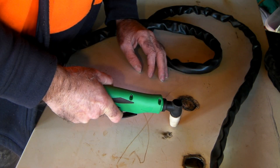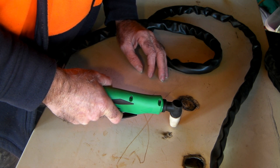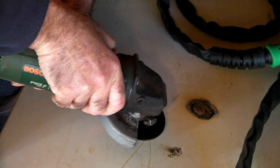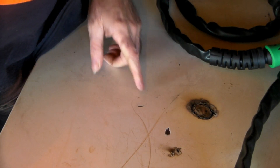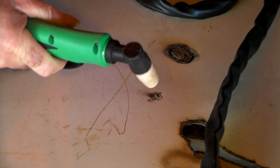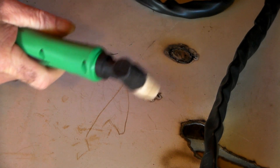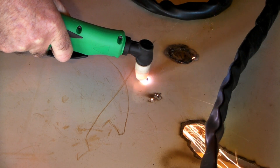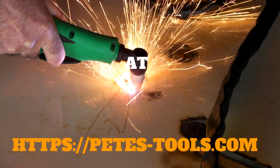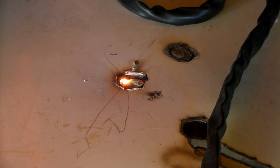See, it doesn't really start because the metal hasn't been cleaned up properly first. So I'll show you how easy it is to start once you clean the metal up a little bit. This is a non-pilot arc torch - all we do is get the angle grinder and just take a little bit of the paint off. That's all you need, just a little bit like that to get you started. So if we grab our touch torch, or our non-pilot arc torch, and watch how easy it is to start there - see how it burns through the paint now - once you get it started, piece of cake, straight through.